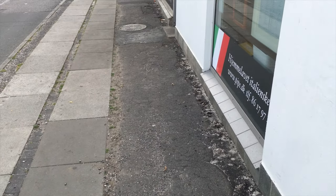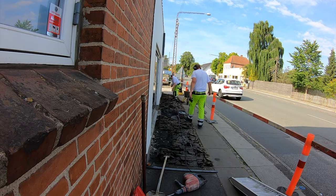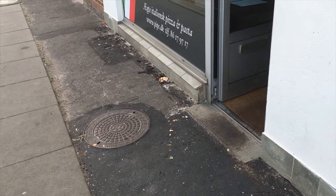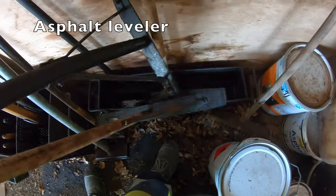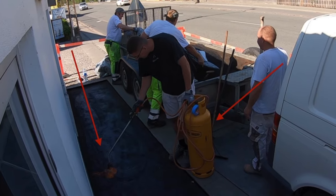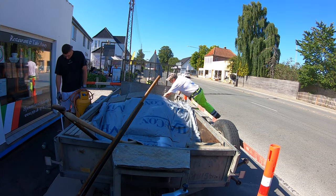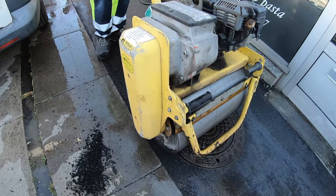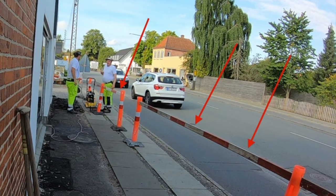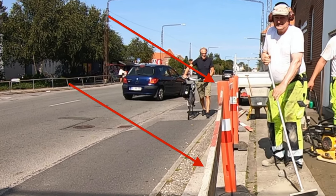Let's start with the tools you need for the project. The first tool I am going to need for this specific project is a concrete breaker, but depending on your project specifications you might not need one. Then some hand tools: a shovel, wheelbarrow, hand stamper, an industrial gas burner with a gas tank, some winter mats to cover the trailer to keep the asphalt warmer, a plate vibrator, a roller vibrator, and an old painter's brush for the primer. Also something that gets overlooked — proper roadwork signs and delimitations.